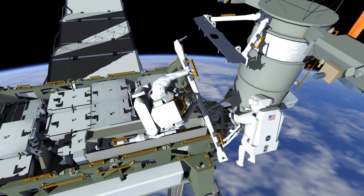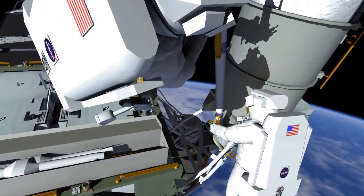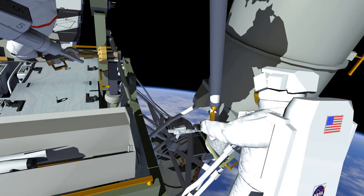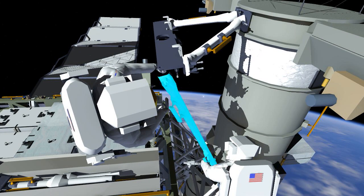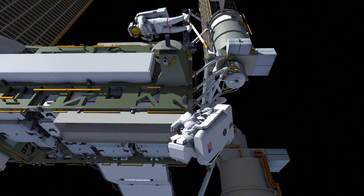With the right lower strut installed, the system is now in a good configuration to leave it out and operate space station nominally. If we didn't have this installed, we would need to perform a tie-down to make sure everything was structurally sound before heading back in. If there is extra time, we'll continue to build the 4 Bravo mod kit on this EVA; if not, we have plans to perform the rest of the install on the next EVA.